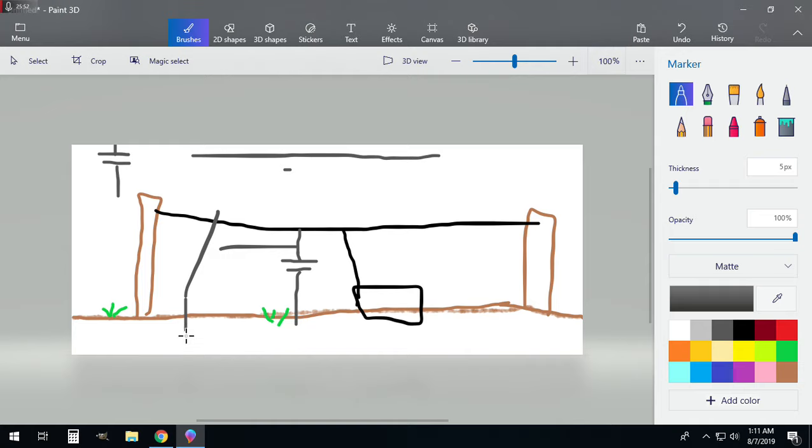The dirt is not really that conductive. So I think a lot of people's problems is they need to dig a hole and put a bunch of metal underground and spread it out, or find another underground stream and connect into that. Basically get a better ground, and through the process of elimination make sure that ain't your big problem. Just sticking a tiny stake in the ground a foot is not good enough, because the dirt is a semiconductor. It's not a really good conductor. So that's one point I was wanting to make.